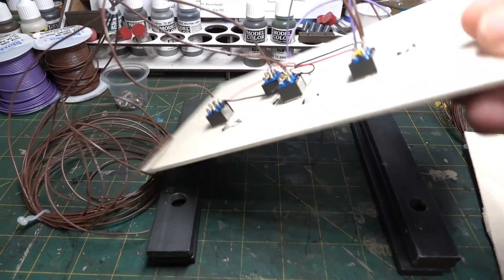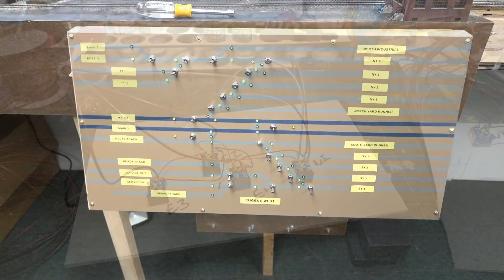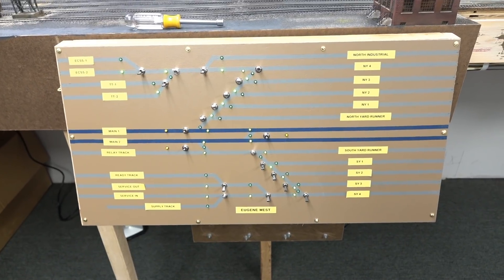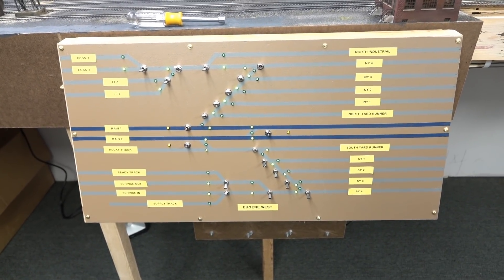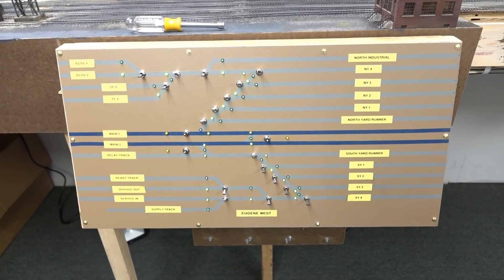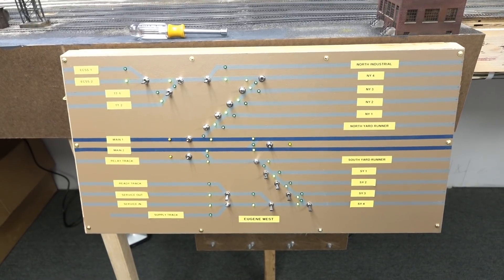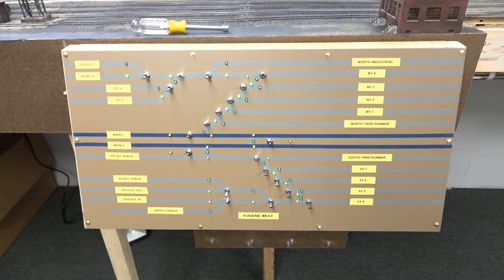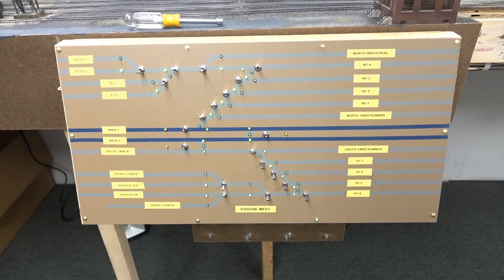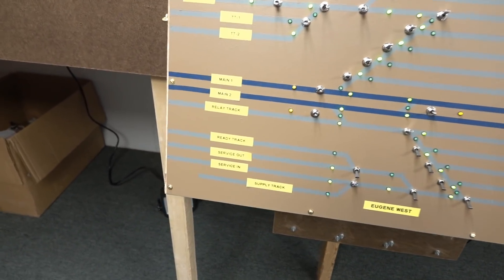I need to be careful not to bend the 26-gauge solid wire too much. Then I put them in and solder the LED leads - a black and red from each LED - and crimp and run the other LED leads back along with these wires to a terminal board. Now the panel's done - not my finest work, lots of troubleshooting. The exterior is masonite and I tried to get fancy with labels, but they're peeling up.